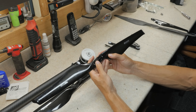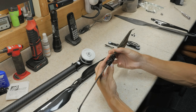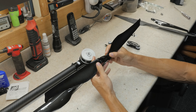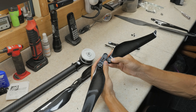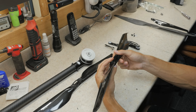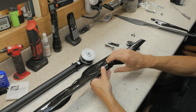As you can see in my hand, this is a 22-inch propeller and it uses M3 screws. Sure enough, I'm using these on MN605 motors which produce about 8 kilograms of thrust. These propellers are supposedly rated to 11 kilograms, and sure enough on my first hard test flight, three propellers failed — all in the first flight. The M3 screw just sheared, and if you do the basic math on it, the forces within that screw at 8 kilograms of thrust flying forward through the air are way higher than that M3 screw can handle, so it's not really surprising that it failed.